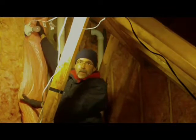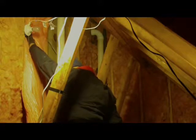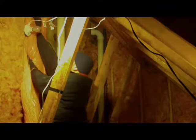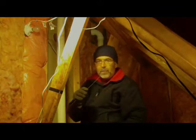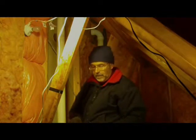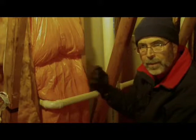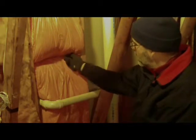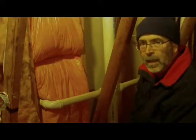Now I'm going to take my insulation and feed it into the wall. The trick, once you get something in place, is to use one of these supports. All you do is push it in and it grabs onto the wood. I grab one of these supports, take it, push it in between the studs, and it holds automatically. It grabs on both sides of the studs and holds the insulation in. It's a great way to go — very quick.